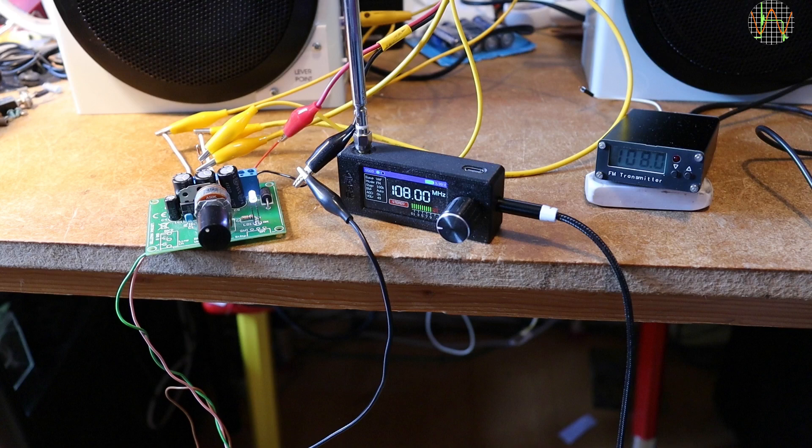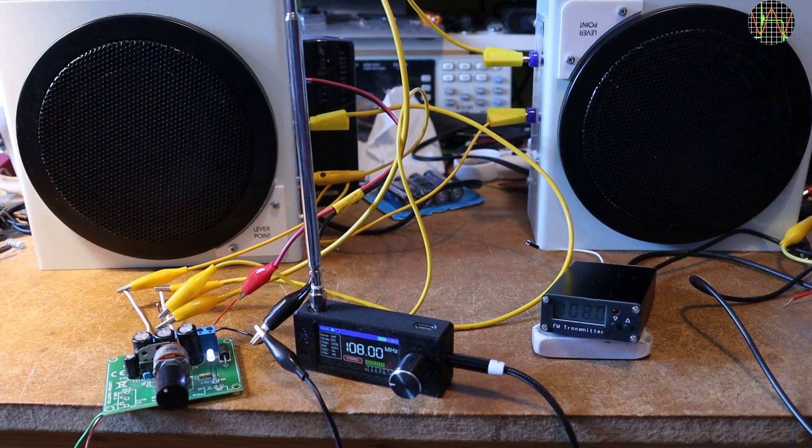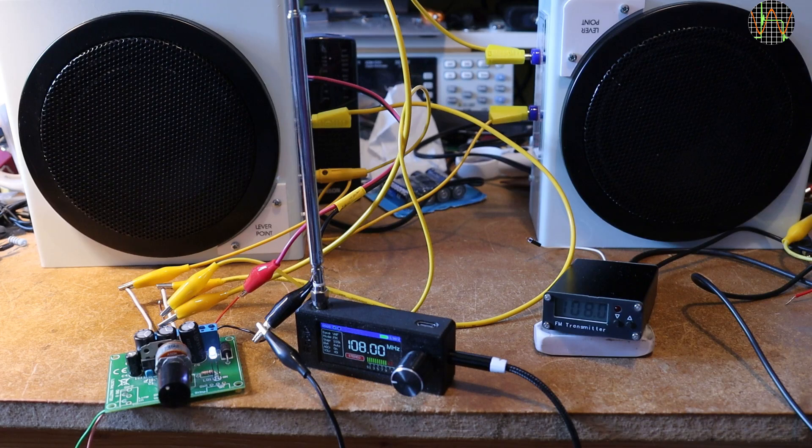It occurred to me that the S14732 has a stereo indicator, but I had not actually verified that stereo comes out from the headphone socket, so I hooked it up to an amp and speakers. Yes, it's stereo — but left and right are swapped in the S14732 headphone output. My test track and the transmitter made this obvious. The only reason it sounds correct now is that I swapped the speaker wires. I also tested the transmitter with other stereo radios and the little amp setup, and neither swaps channels.